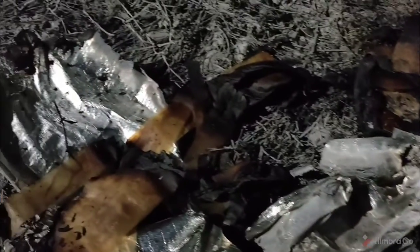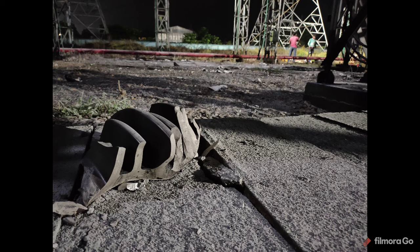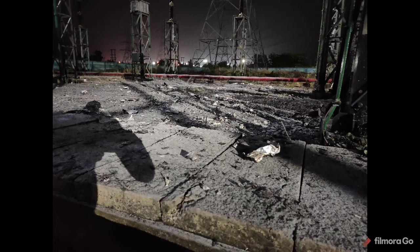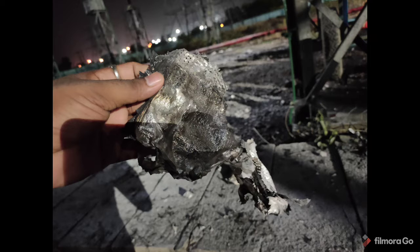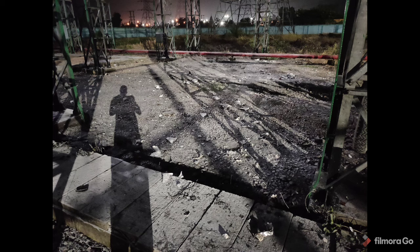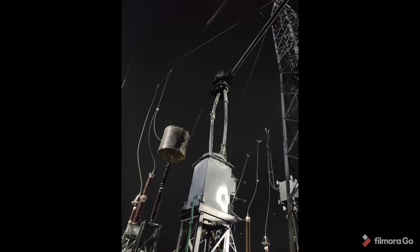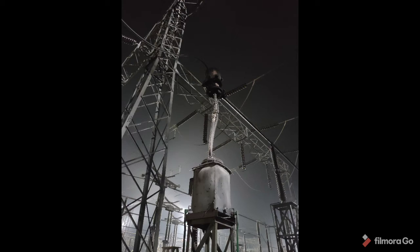You are seeing the paper insulations inside — these zones are burned out and already converted to carbon. The total paper inside the current transformers is just burned out. You are seeing the inside insulation reduced to ashes because all things are burnt out.